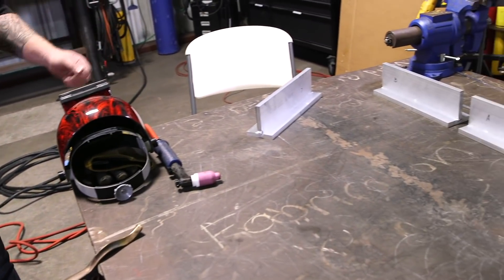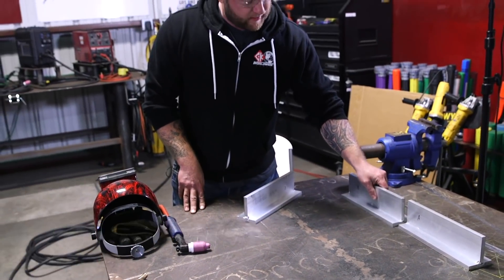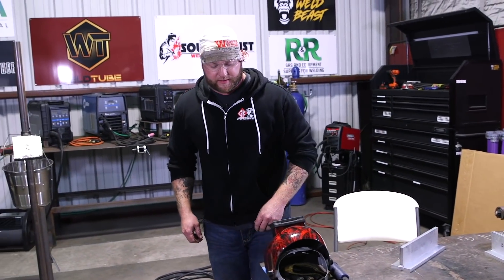Like I said in the intro, we're gonna be doing some aluminum welding today. As you can see on the table I've got some coupons set up — half-inch 6061 T6, just tacked together. I have a pretty extensive background in aerospace and robotics, so we deal with a lot of thick aluminum where a DC straight aluminum welding process isn't really practical. A lot of times they need the aesthetics of AC, and a straight DC arc on aluminum is dirty, grimy, and very deep-penetrating but doesn't have that look. So they prefer everything done on alternating current from start to finish.